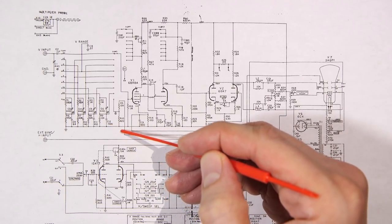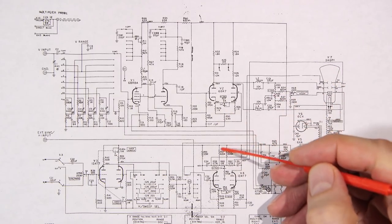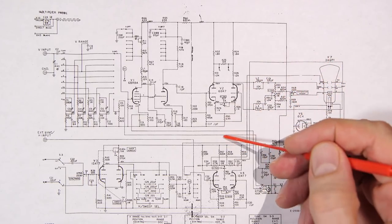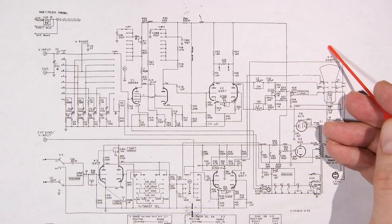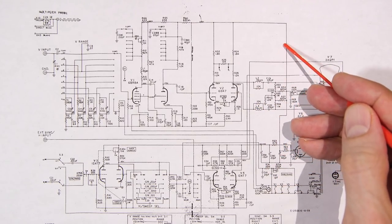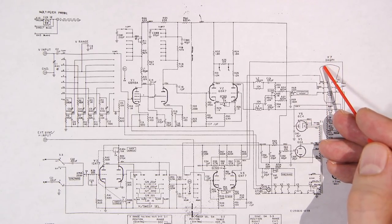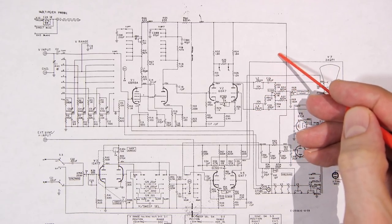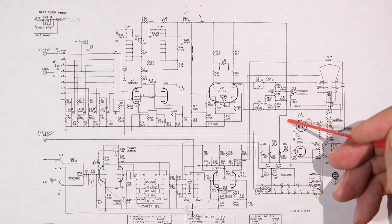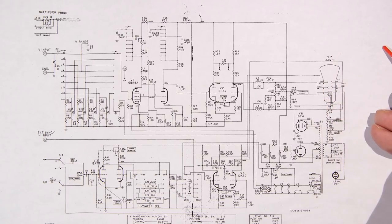So if you start to get a ramp that starts to go like this and then come down, more of a sawtooth, the sawtooth effect at the top is capacitance. And when you start to deal with capacitance, as this is slowing down and lingering, it's going to affect the speed of the trace. As it gets to that lingering part up closer to the top, the trace will be fast and then it'll slow down as it gets to the end, and then be fast and then slow down, because it's more time in this area here as it's getting to the end, right? So you want that as steep as possible and then to come back down and then as steep as possible.